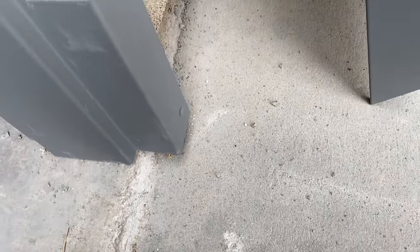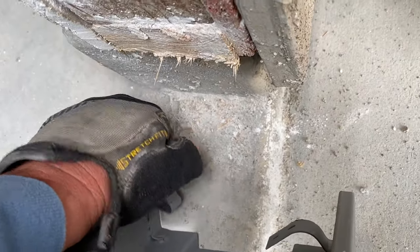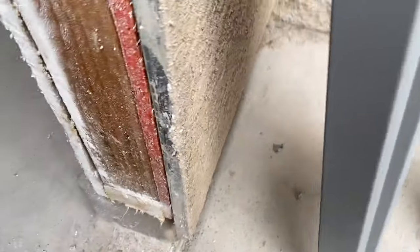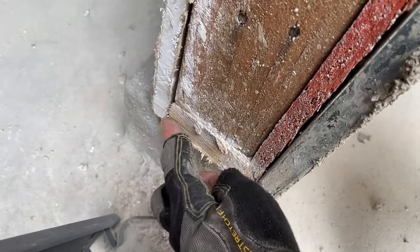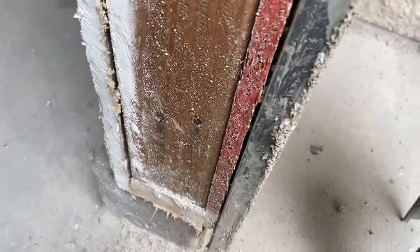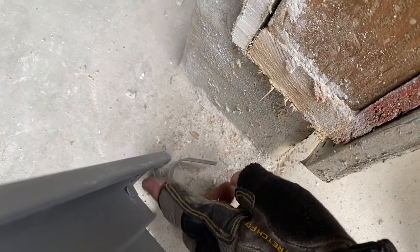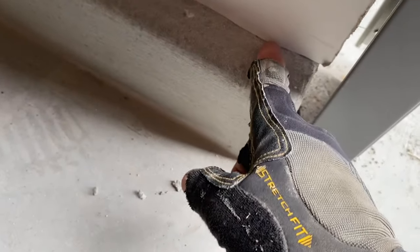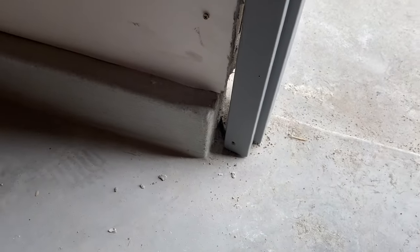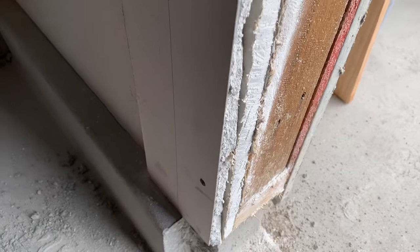They have these straps — this is for new construction. These straps pull out like so, and if the stud were to go all the way to the bottom you would wrap this strap around the side of the stud and put a screw in to hold it in place. It's not going to work because we have concrete down here, so I just take an angle grinder and cut these things off. Obviously we're going to have to mount this thing in an unconventional way — it may have to take out a portion of this concrete. You've got to have good concrete tools and metal tools when you're doing this.